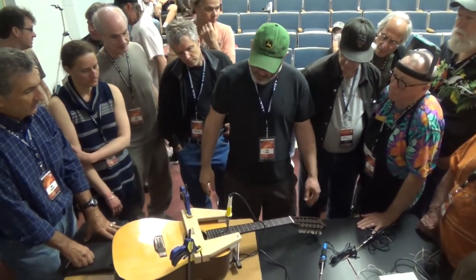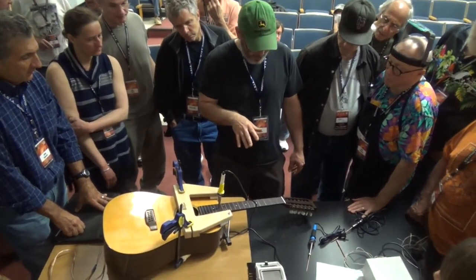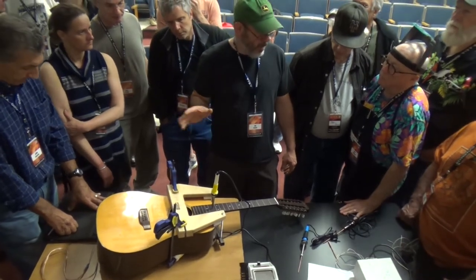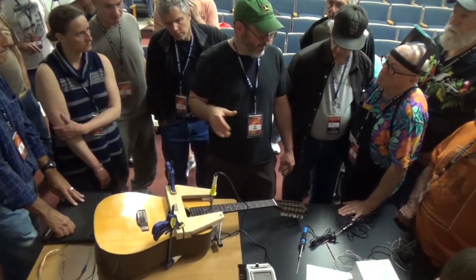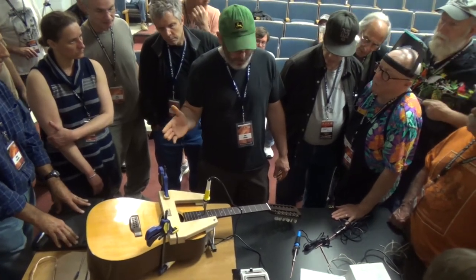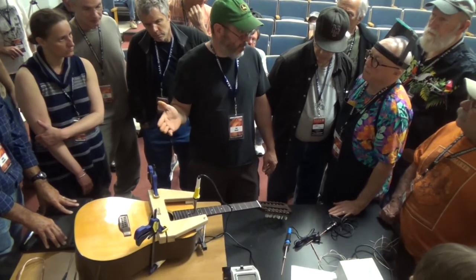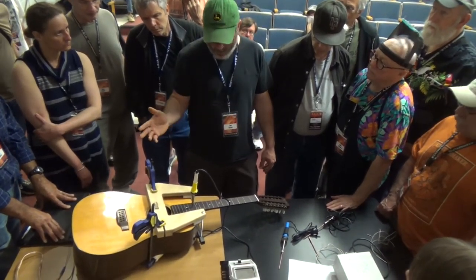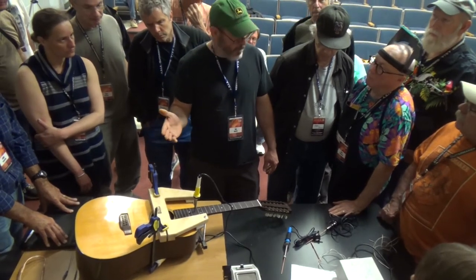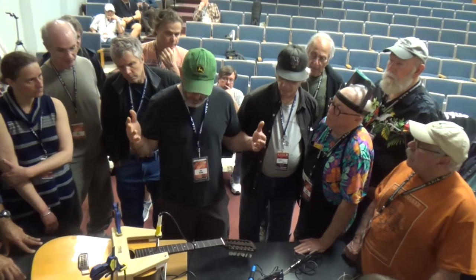When I drilled that, it gave that quintessential feel, like, I'm drilling and I'm letting go. So another thing to think about on this is the economics of neck resets. When I said I get slightly under $500 for a neck reset, the neck reset has changed in my life. Now we're doing fingerboard extension shims. I'm painting my fingerboard extension shims to make it look like they aren't there, and fitting the dovetail to where it'll hold string tension. In the old days, guys would do business cards and stuff like that.